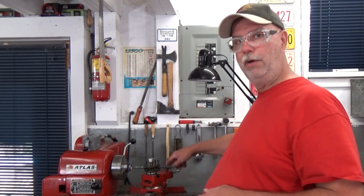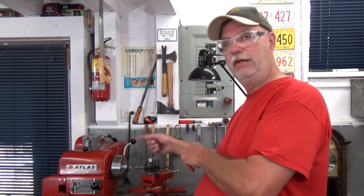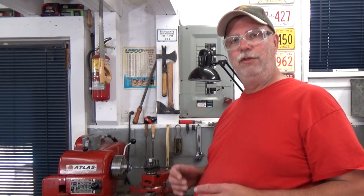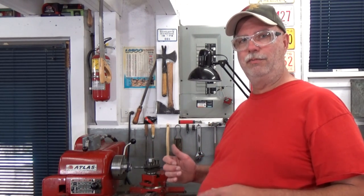I'm going to use it as an indication. So 50-52 thou is my total depth of thread. I'm not going to go there. I'm going to cut up to about 45 thousandths of an inch depth of thread, measuring on my compound rest because it goes from zero progressively deeper. I've zeroed both scales of my two axes with the tool just barely touching the edge. So when I see that I'm somewhere around 45 thousandths of an inch, well, that'll be a good time to start checking with my gauge. So enough talking, let's start cutting.